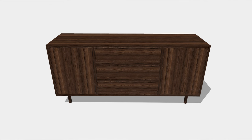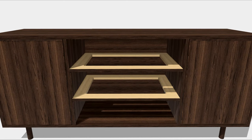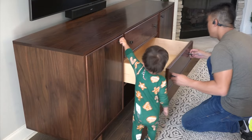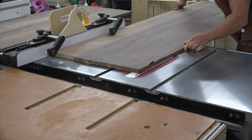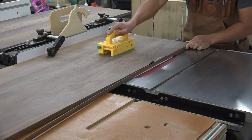My wife wanted a modern looking sideboard to replace our current credenza. We designed it to have three long center drawers flanked on either side with a pair of doors. She settled on a mid-century design with short turned legs, and I settled on adding decorative beading around the drawers and doors to add a slight traditional period feel. We both settled on walnut as the wood species and I started off by milling four-quarter walnut for the carcass top, bottom, sides, and vertical dividers.